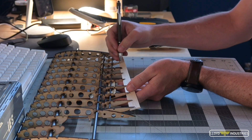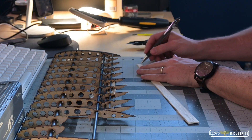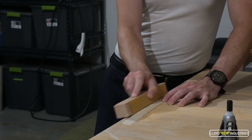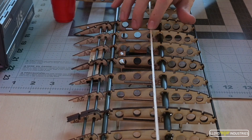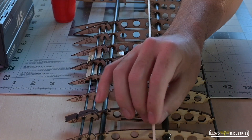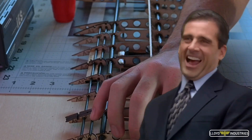While the epoxy was setting, I carefully measured all the trailing edges once and cut them all twice. Sanded the edges down to a chamfer and began gluing the balsa wood stringers along with the trailing edges. It was so satisfying pushing the wood into the perfectly sized slots. Repeated this a couple more times, then did the same for the control surfaces — a tad more sanding and they were pretty much ready for the monocoat covering.